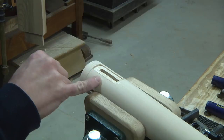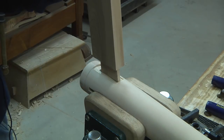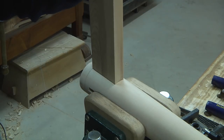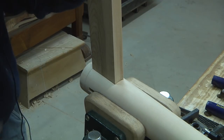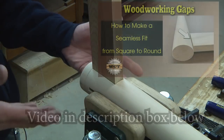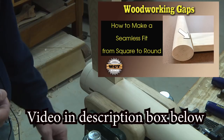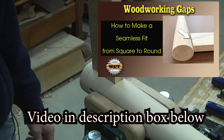Okay, to make sure I got rid of those gaps, I just notched down on this a little bit. And what that does is it allows the stretcher to recess just a little bit, eliminating any gap. If you haven't seen how I did this procedure in the previous video, I'll make sure to leave that in the link in the description below.